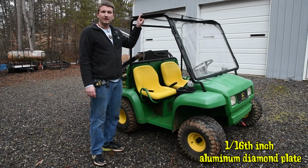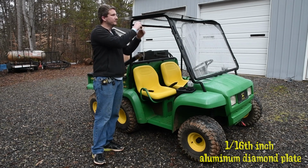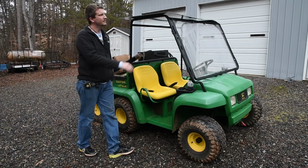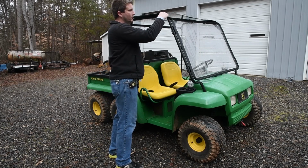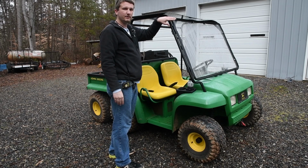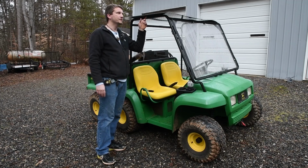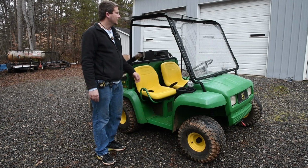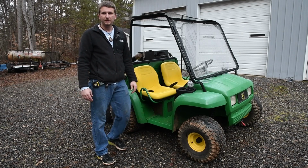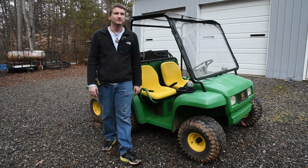All right, so we got the metal on top here. We're going to plan to bend it on the side, give it a 2-inch drop, 2-inch drop on the back and the other side, and then about a 45 degree angle. It's going to be about 3 inches length on the front section here, just to mate up nicely with the 2-inch sides. I'm going to do a couple practice cuts and welds on a piece of scrap that I've got, so let's get to it.